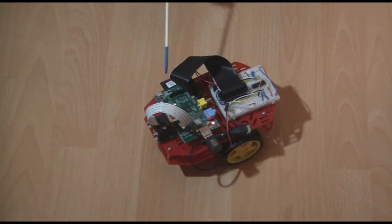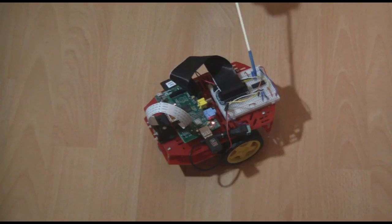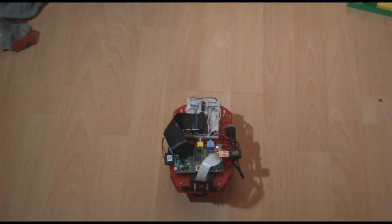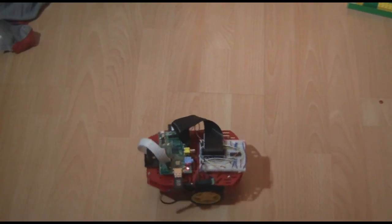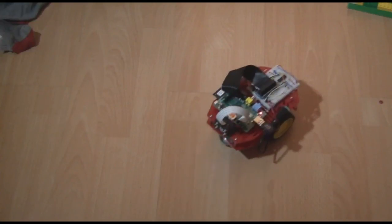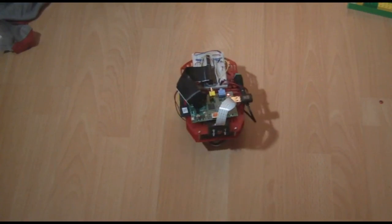The Raspberry Pi is mounted at the front of the chassis. It has a WiFi USB dongle to provide the wireless network connectivity. The Raspberry Pi GPIO port has been connected via this cable to the breadboard. On the breadboard is an H-bridge integrated circuit which is used to control the motors. I've also mounted a Raspberry Pi camera to the front.